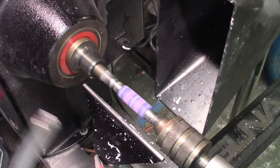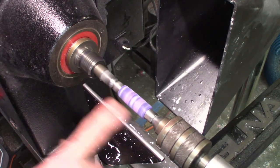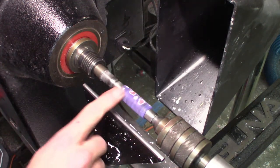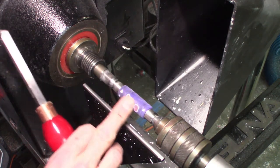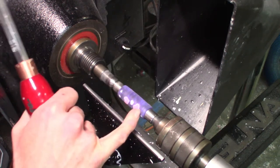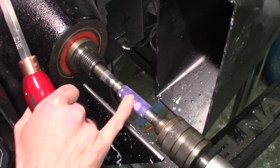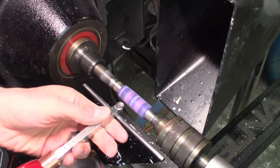But you can compare it to Alumilite, or most of your resins are going to be somewhere in the Shore 80D. And I think that's pretty close to what these resins are. So when you're turning it, there's not a big difference between your casting resin and the 3D resin. So it works pretty good, but I will say that filaments work fine too with these.